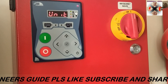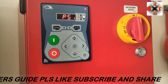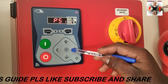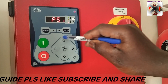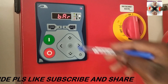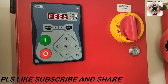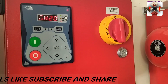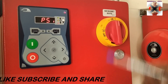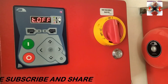The next setting is the units — the units in which the system will operate. Generally it should be in PSI, and right now it is already set to PSI. If you are somewhere that requires bar, you can press forward then press the up key to select bar and save it. There are also other unit options available. I want PSI, so I'll press okay and go forward.